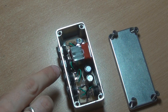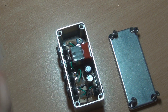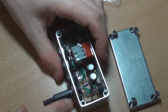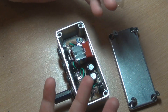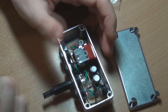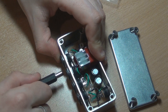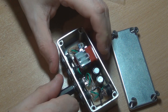With these DC jacks, you don't have to use four of them. I should have checked the schematic and layout before I built it. You could just use one because they're all in series anyway — just get a DC daisy chain that's got enough connectors, like 10 or however many you need, and just use that instead of having these four or five individual sockets. It's just a pain drilling all these holes and fitting all these DC jacks when you can just use one daisy chain.